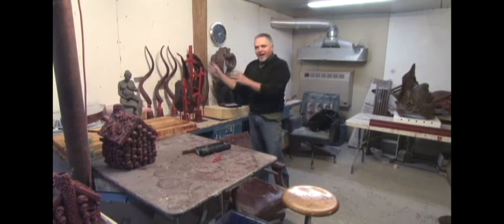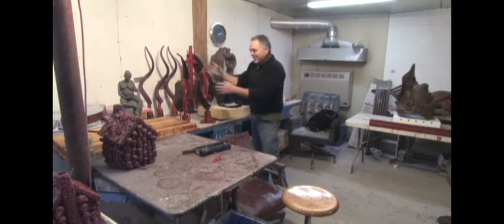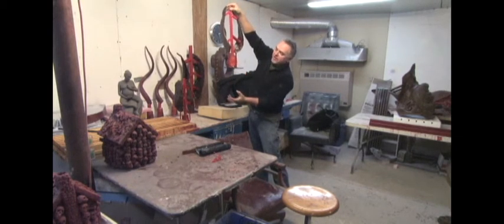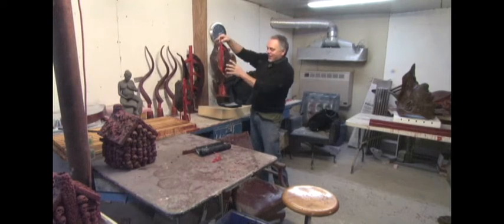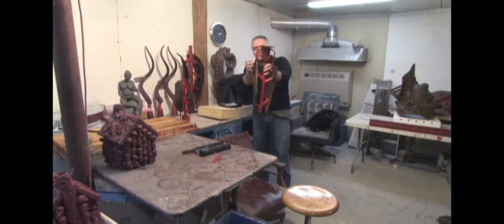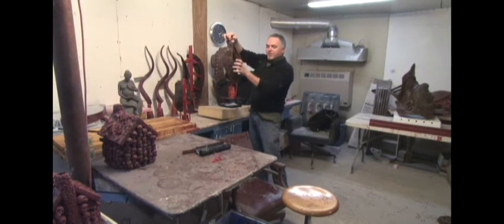With that we'll be able to fire these individual pieces as ceramic objects and vitrify the ceramic shell, creating a new ceramic object that actually contains all this wax — so basically it's going to disappear. We'll enter this ceramic object from the bottom, remove the wax, and fire the whole piece. The wax will heat up evenly and quickly and drip out the bottom. Once cleaned and prepared, we turn it over, sink it in hot sand, and pour bronze in, which will distribute throughout the pattern, rise to the top, and exit through the vents into the cup. An hour later we can break off and destroy that shell and discover the casting.